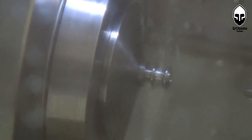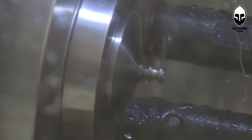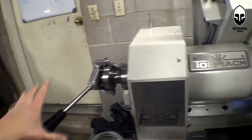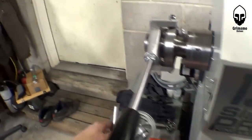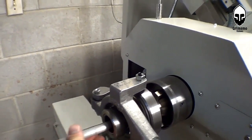It does squeak a little bit on the way out, but it works great. And that's all there is to it. The run takes 1 minute 20 seconds. So with the collet closer, it's sort of manual-slash-automatic operation because it makes it fairly quick to go to the next part. If I loosen that, the bar is a lot shorter now — it's way in there — but then I can tap it forward.